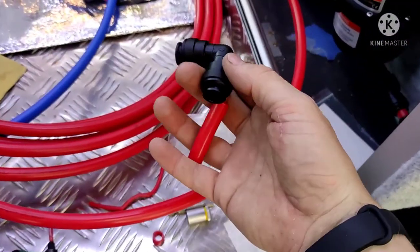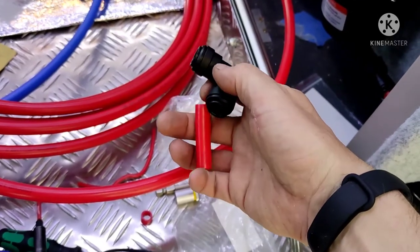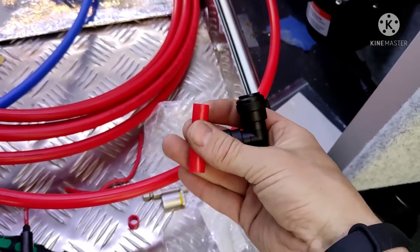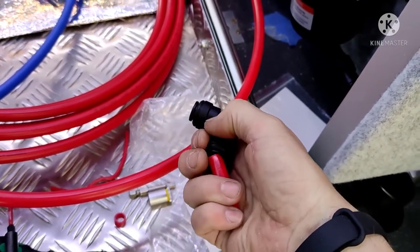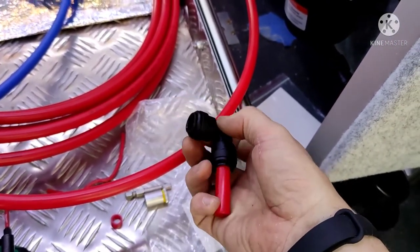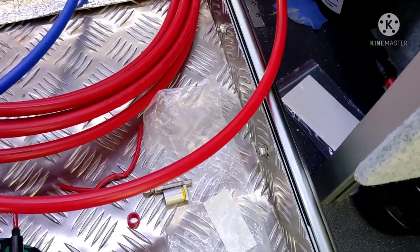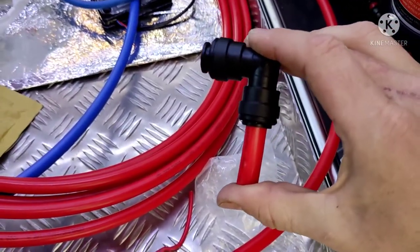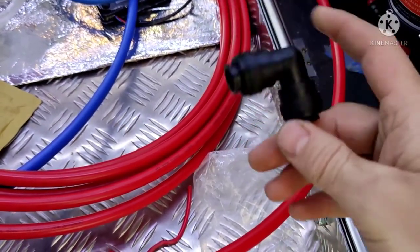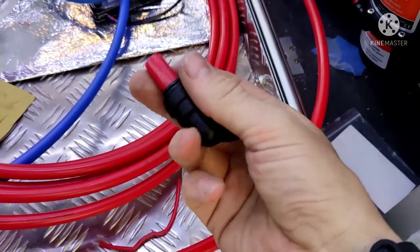I'm doing this whole lot out of 12mm push-fit John Guest fittings — a semi-rigid pipe. You cut it to length with a nice square edge using a decent pair of cutters. Then all you do is push it in, and that's it — that's locked, watertight, all done.